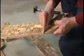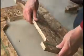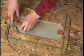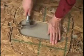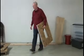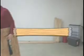Now lay the legs into the center of the frame and align the small tenons on the leg with the dados in the frame. Now place the pegs between the bottoms of the legs, pushing them loosely in place, and tap them home with a hammer. This allows for easy handling and storage of your knockout horse.